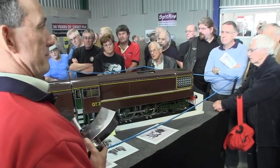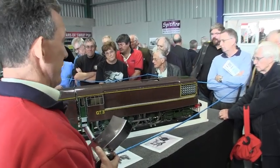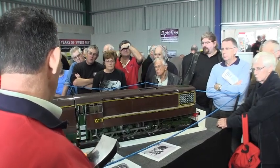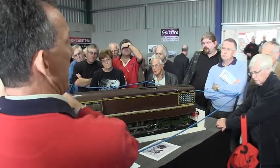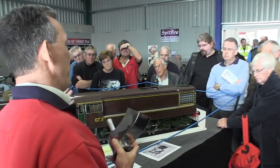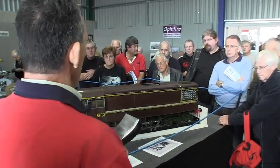The mechanics from that output upwards are identical to an internal combustion engine aircraft rig. Both this engine and this locomotive are turbo props. This little engine at 160,000 rpm is producing 14 pounds of thrust. However, once we capture all that energy — otherwise thrown out at high velocity and high temperature — and turn it into shaft power, we can turn a nice big prop that will actually develop 50 pounds of thrust. So we're making much better use of the energy inside the machine.